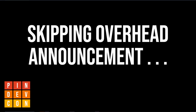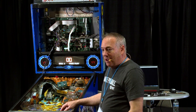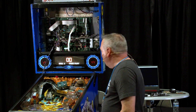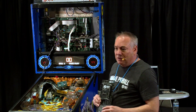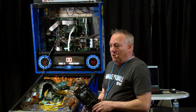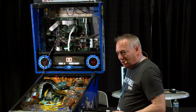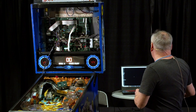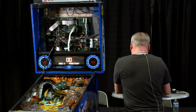Because we had so much leftover horsepower — the original pinball machine GI circuits only had 16 shades — we have a dedicated processor on the bottom board running all the hardware. So you have the power, you may as well use it. We ended up putting 256 shades of light on the GI. Let me try to demonstrate that — I don't know how well it'll work on video, but this is what this is.